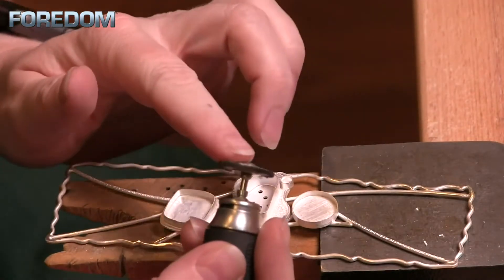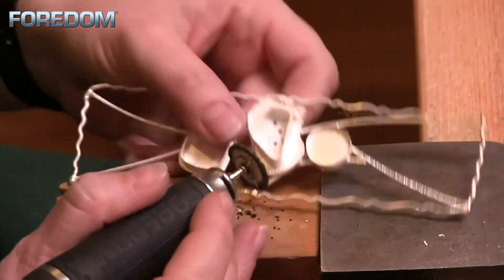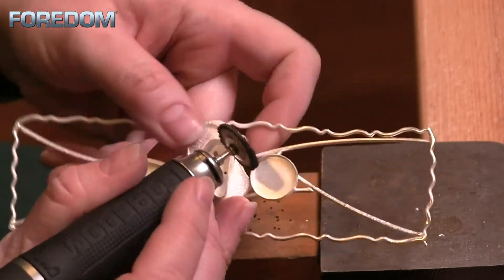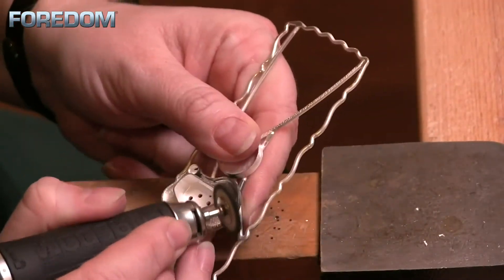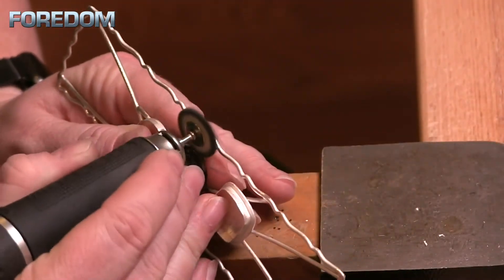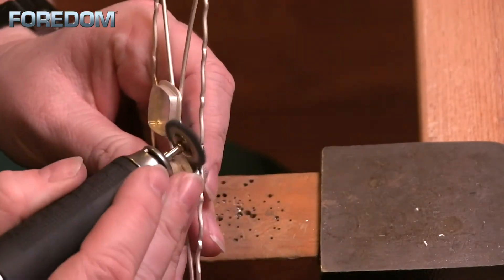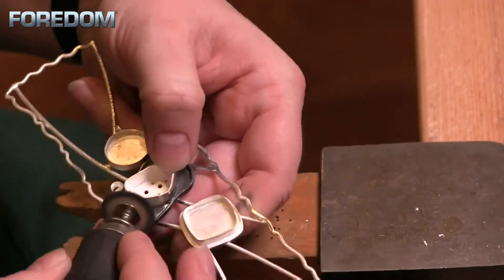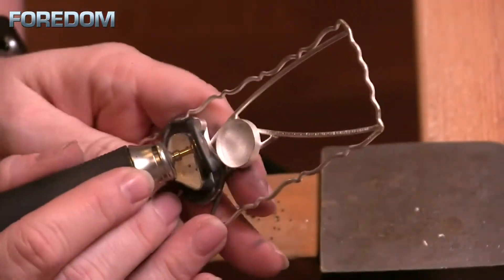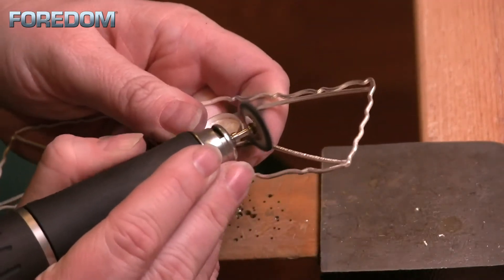For this I'm going to use the white horse hair — it's pretty stiff and it's going to get into these areas really well. Using a stiffer brush with Tripoli, which is a cutting compound, is going to have a little bit more of an aggressive cutting. So if I need to remove any scratches or dents or divots, I want to use an abrasive that is aggressive with an aggressive brush. This white horse hair isn't too stiff but it definitely has enough power to get into areas.